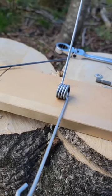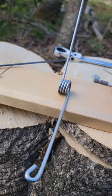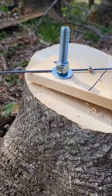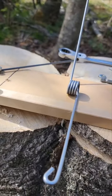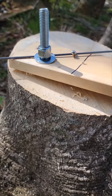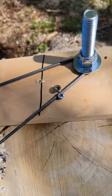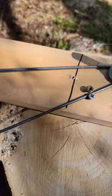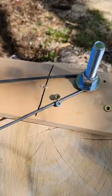The original spring has four winds — I put five winds on the one I made before, but I'm gonna stick with four winds on this one because there is a little bit of a tight space to get this spring in there. So I'm gonna wind it four winds to the left. I'm about halfway on the first turn and I'm just holding the wire here with both hands as I pull.